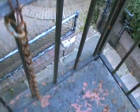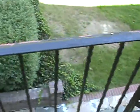So that's the issue as to whether we replace these railings with new railings, or the repair has to be a bolted connection repair, because you can't weld unless they come in and isolate certain areas that you're going to be repairing. But there's too much work on all the rails. All the rails on this one are very bad, to the point that it's eaten some of the seat channel.